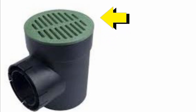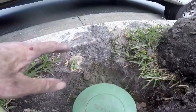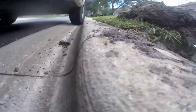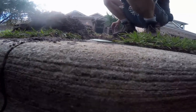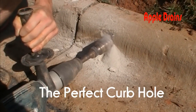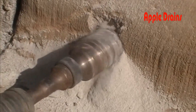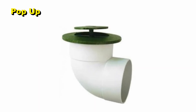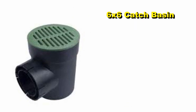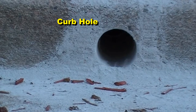This is six inches of fall lost from the backyard to the street. I'm not saying a pop-up doesn't work, but when you have a very level line and you're trying to maintain the fall from the backyard to the street, look at what happens — you lose all the fall right away. Much better is to drill the curb hole. There is no single correct answer; it's really your preference as long as you've got a good working system — they all work.